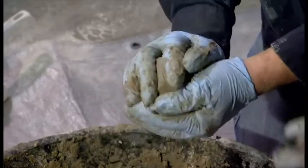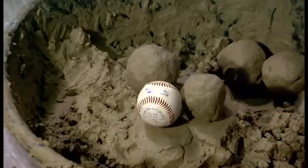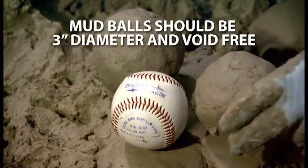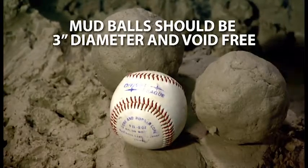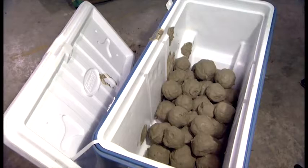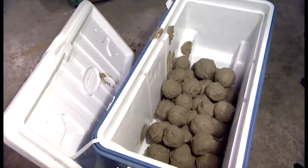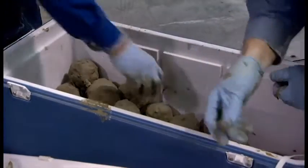A well-processed mud mixture will look like this. Prior to use, the mud mixture may be formed into balls and stored in sealed containers to prevent evaporation. For handling purposes and to work out fissures and air spaces, the mud balls should be around 3 inches in diameter, approximately the size of a baseball. If the mud balls are not used immediately, store them in containers that are either sealed or covered to slow evaporation of the water within the mud. The mud balls should be stored at near room temperature until they are ready to be used.